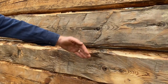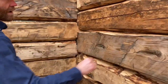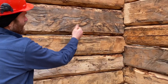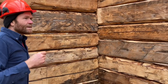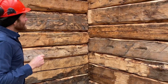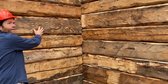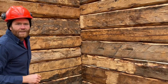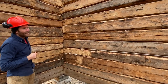Some of the smaller vertical cuts were scoring marks that were used to sever the fibers, and then the bigger broad axe would have come in and taken that piece off. If we compare some of the logs and the finish on them, we see this nice smooth log and then another log that's quite rugged with lots of big fish scales on it. That probably tells us one of two things — either this was hewn by the master, this was hewn by the apprentice, or this was just a really ornery log with some non-cooperating grain. Every log does behave differently for sure.